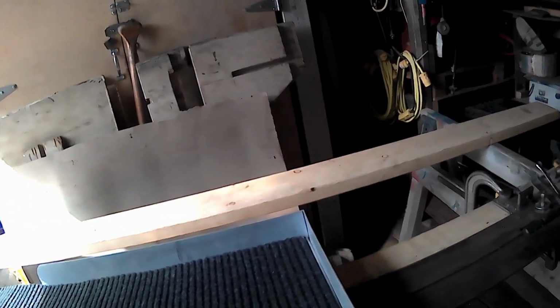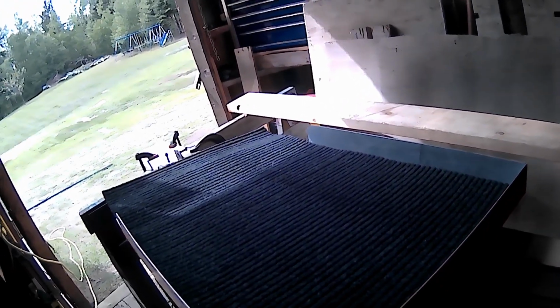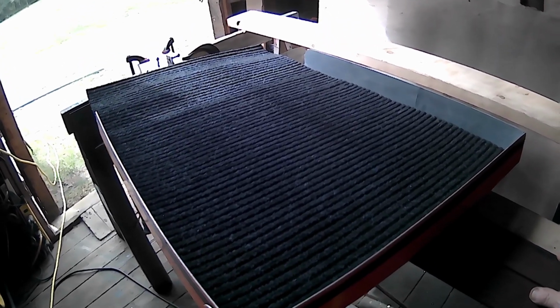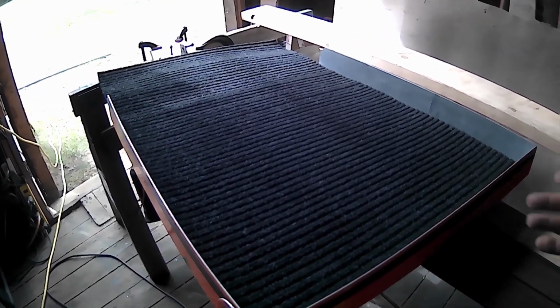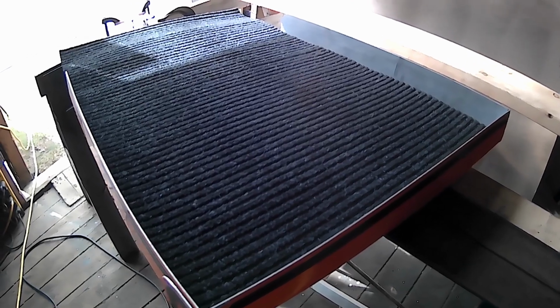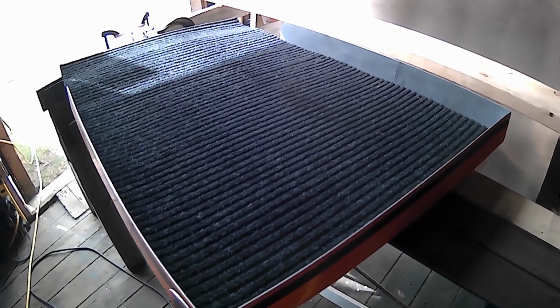One thing I was also thinking about doing was I could make legs off the end of the angle iron, or I could make like a little rocker out of it, and you can just dump your dirt in it and throw some water on top of it and give her the old shake, and away you go. But that's going to be perfect for putting on the end of a sluice run to capture all the coarse or all the tailings coming out at the end of your sluice run to see if you're blowing anything out. And if you are, this is an extra capture zone. It's nice and wide. It's going to, like I say, have multiple pieces of expanded metal in there. So I'm thinking this should do the trick pretty good. I'm looking forward to seeing how it's going to work in the field.